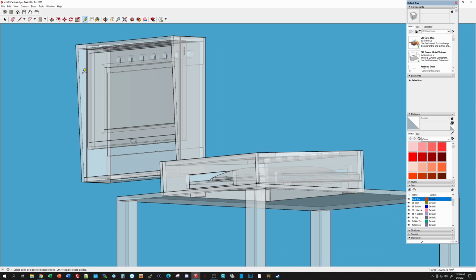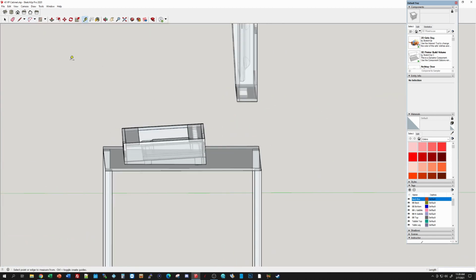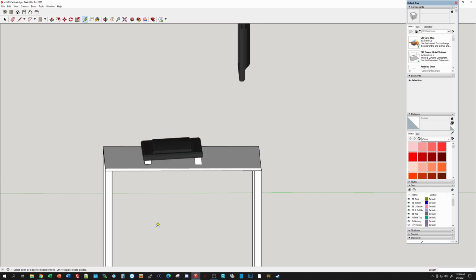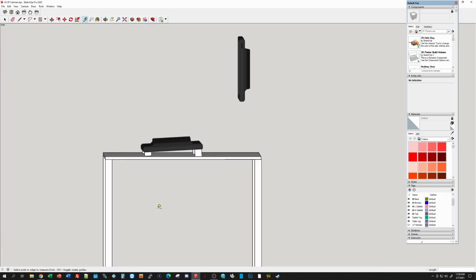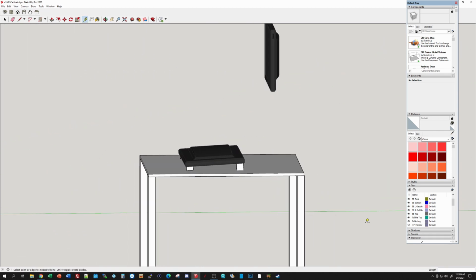Anyway, so what you want to do is cut yourself some blocks. You want to cut 2 at 53 mil here and place them right there, and put your TV flat down, just like how I have it drawn here. Let's turn this X-ray off here for a second. Okay. Now, let's turn off this back box here. So right here, I've drawn these little blocks, and I place the blocks in the 4 spots here, just like that. And then you put your back box on top.